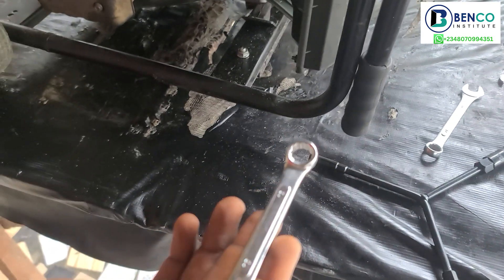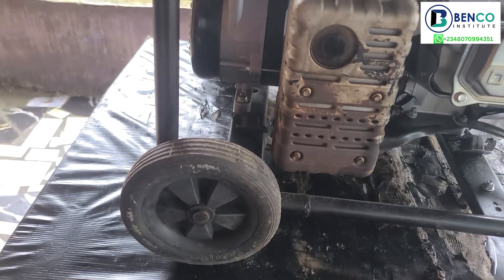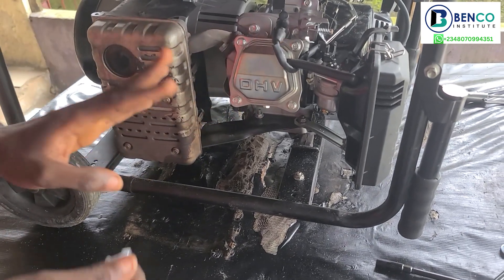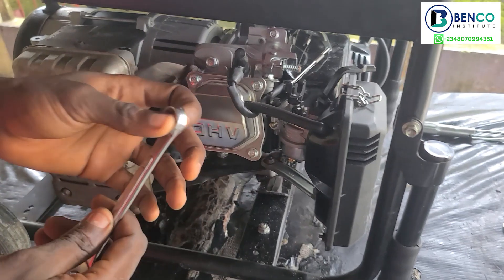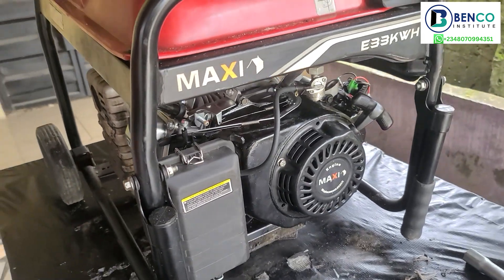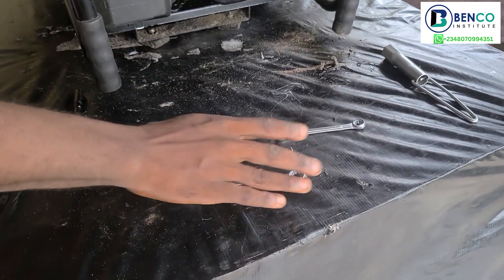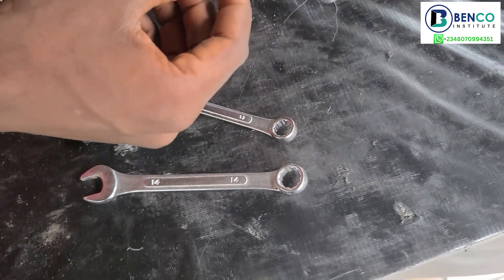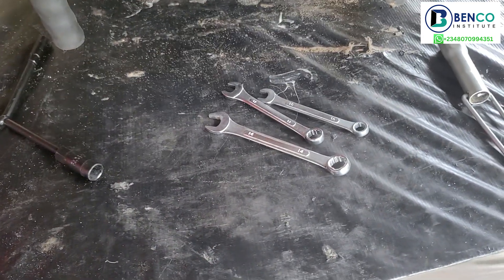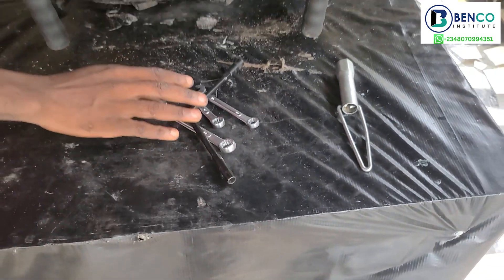The same applies to a 12 bolt — I may have the other spanners but I won't be able to loosen it out, so I'll use the 12 combination. I also need a 14 combination because of the valve. If you loosen this out to set a valve, you will need a 14 spanner — that is necessary to set a valve. As a young person coming into generator repairs, you may not be touching the valve yet, so it may not be necessary to have this right away. But if you have the resources, get combinations in 8, 10, 11, 12, 13, and 14. Without those you can still use the other spanners to basically fix your generator.